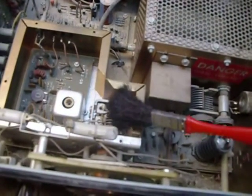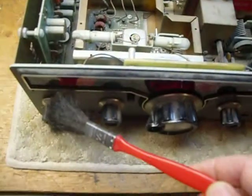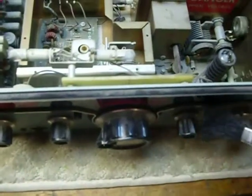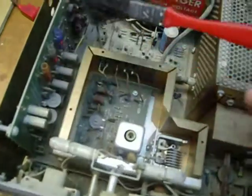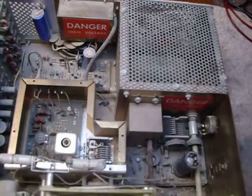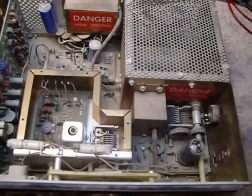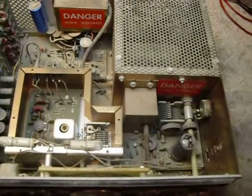The first thing is to get all this dirt out, lubricate the capacitor bearings and wipers, then lubricate the shafts on the controls. I may have to put a drop of oil inside the controls with my hypodermic syringe. So that's what I'm going to do right now — just a brief look at a new project. 73s and good DX.